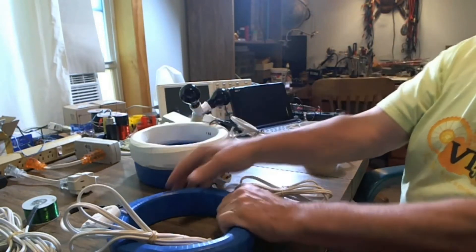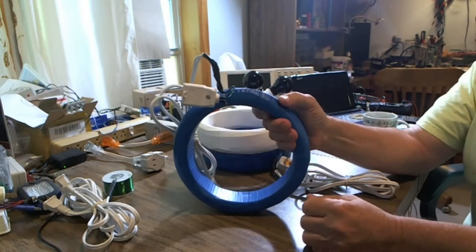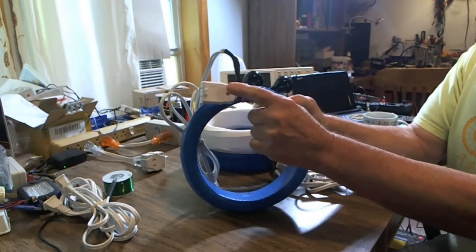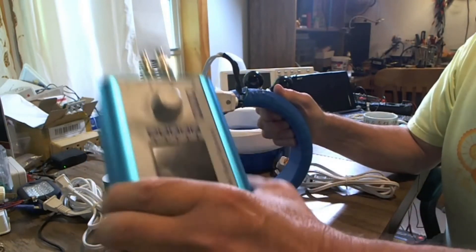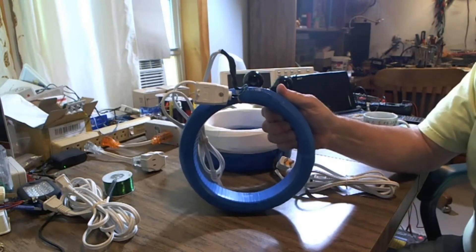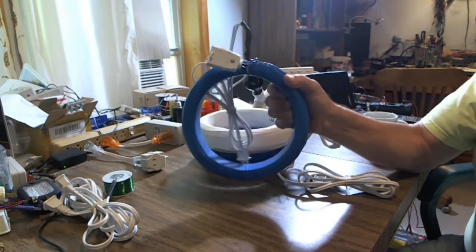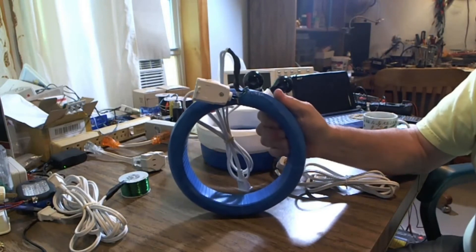This new coil has a single wire coming off, and it has a plug for the secondary winding. It's got two windings inside: one is a 12-gauge winding, and the other is an 18-gauge winding that I'm pointing to right now. The 18-gauge winding has a female receptacle on it, and a cord comes with it, so you can make a two-channel coil out of this and have two channels to plug into the Spooky or whatever function generator you're using. This coil can do all the things that the magnetic coil can do, but with more power.